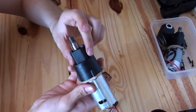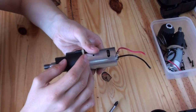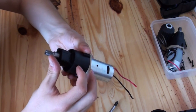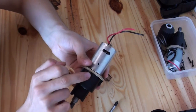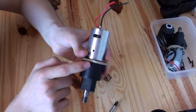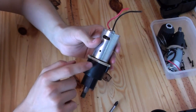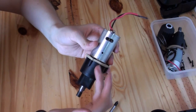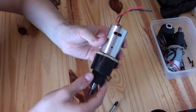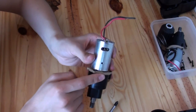So that's more or less your drill unit. Once you've got the grub screws in, you're ready to go. There's one more step: if you're going to be using this in a high-power situation — perhaps over-volting the motors for a bit of extra power, or you know you're not going to be soft on throttle — the first stage of gears in these are often plastic. It's worth checking, because if they are, it's quite a real possibility that when you gun the throttle they'll shred. That's not a problem in a drill situation but in a combat situation it's win or lose. We lost all of our gearboxes that we didn't modify in the first Tormentor robot, so for the second one we've learned a lesson and made them all metal. The second stage is always metal; the first stage sometimes is, but if it isn't, it'll be plastic and you'll want to replace it with metal ones. They're always going to be the same size for this scale drill.